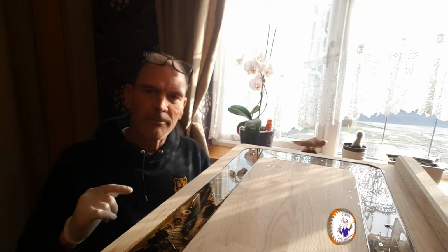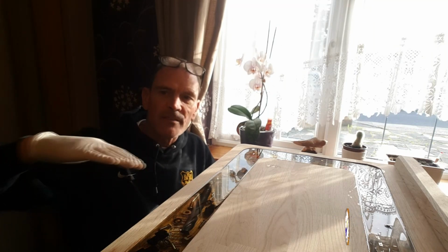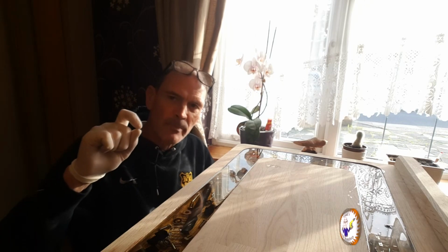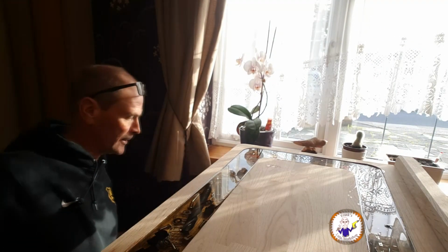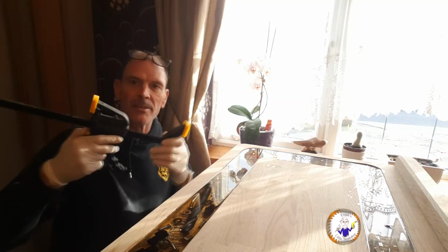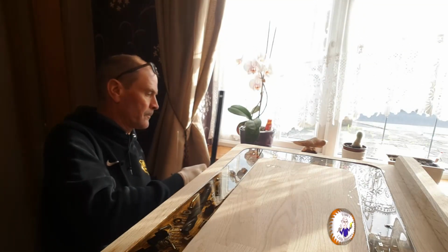Right, this might be a bit difficult to see, but on this corner here, the resin is very close to the corner. So what's happening, even though the table's level, it's flexing, and this corner is lower than the rest. So when I get to the last millimetre, it's going to end up spilling out this side, but it's still going to be a gap the other side. So what I've done is I've got a stool here underneath, and I've got one of my clamps on extend, and I'm basically going to try and lift this corner up very gently.